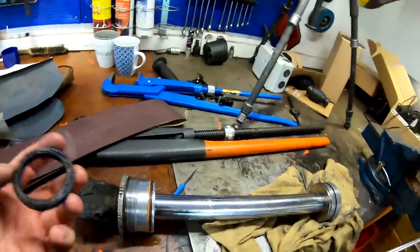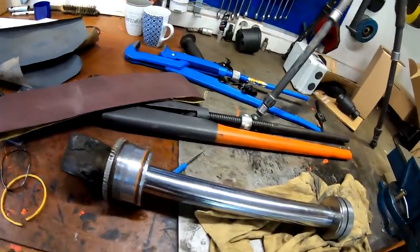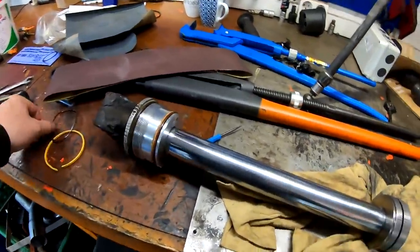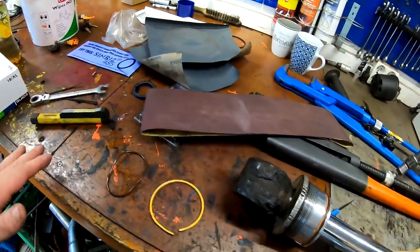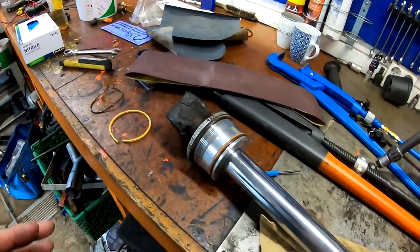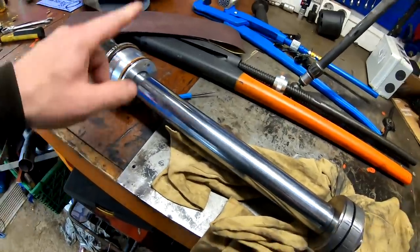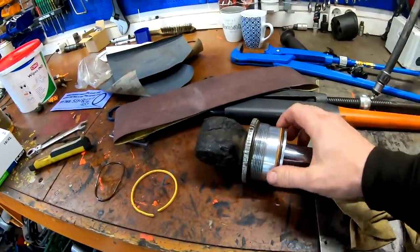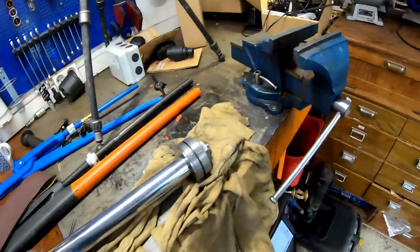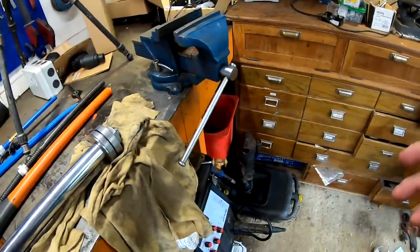And the same if you're going for the seals, the support is supposed to be on the other side of where the pressure is. So if you keep that in mind, you don't need to do like I did in that video when I laid everything out, just to remember the way they are going back when I was putting new in and everything. So just knowing that this is the support ring and the opposite side of the pressure is a lot easier. But I'm not doing this now since it's broken here. I will start and see if I can find a new cylinder for it or something, but we will change the seals here, put everything back together so I can use it still.